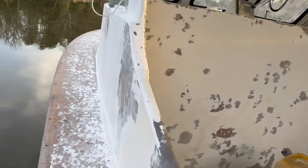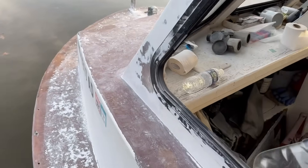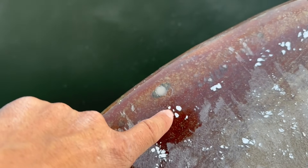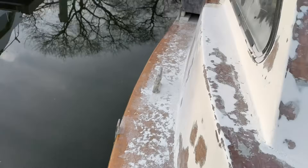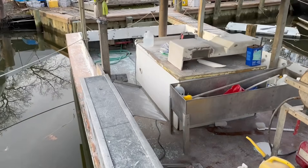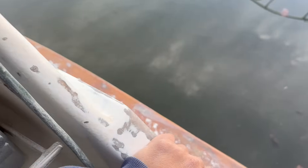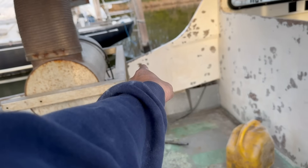All sanded up. The whole cabin is sanded down — I've been up here filling all these holes with glass. This is still tacky so I can re-drill holes. Got the whole cabin, the whole crab pot winder area. And just like any other project, once you get into it, you tend to find things you weren't looking for — like little pieces of the washboard that need to be cut out and replaced because they got some moisture in them. I'm going to fix that tomorrow.